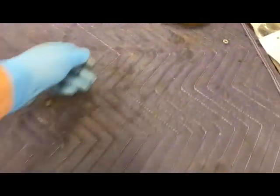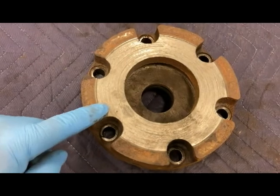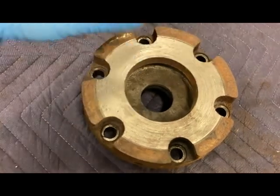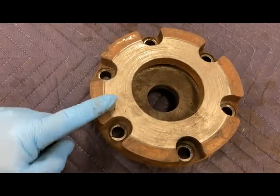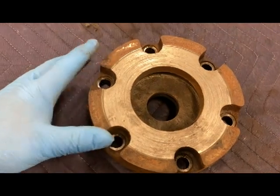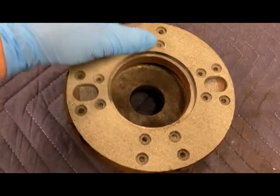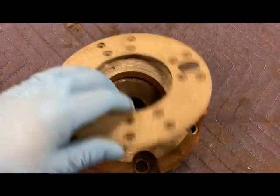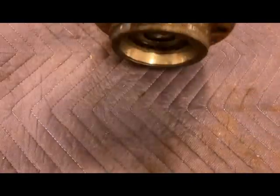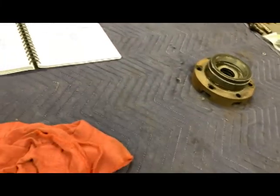Let's look over here at our differential — the one that was worn out. This is why you can see that this was the small brake shoe, and that small brake shoe should have been turned the other direction. This whole surface out here is the wear surface for the full disc. We've got this other disc here and you can see this would have covered the entire area. So somebody had been in there and worked on those brakes before and put the brake drum assembly in incorrectly. But no big deal — we've got it in the correct way now.